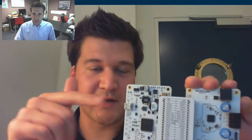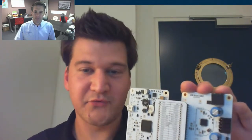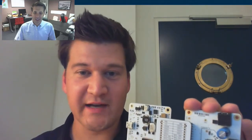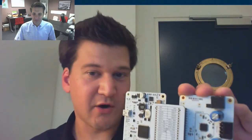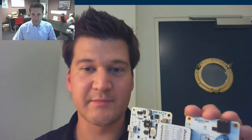So fully connect your motor before you connect your supply voltage or power supply. When you've connected it, attached the motor, and provided the supply voltage, you install the TMCL IDE — first download it, then install it. Then you hook it up with USB. The IDE is designed to be as simple as possible, like a plug-and-play experience — what's called a 'Gooby,' a good out-of-the-box experience. You connect the USB connector and everything gets installed completely automatically. You have a parameter set that works with nearly every motor. The only thing to be aware of is you should set up the current first — for example, if you have a 1-amp RMS motor, set the current in the TMCL IDE first to avoid damaging the motor.